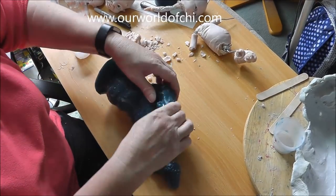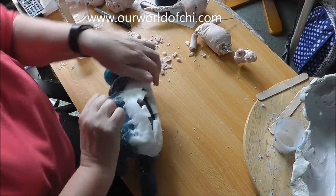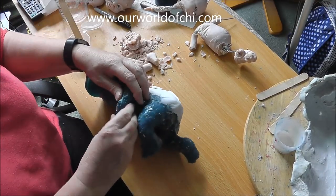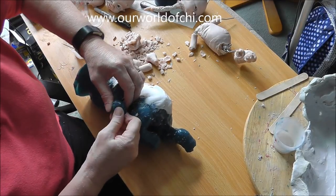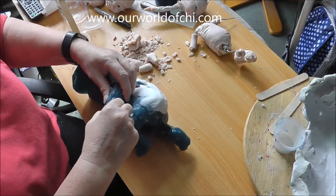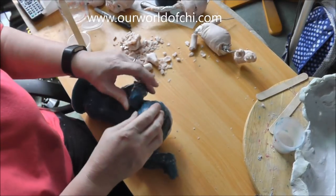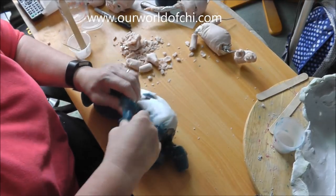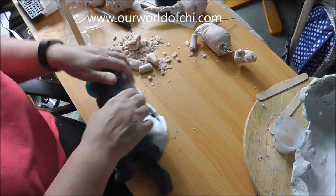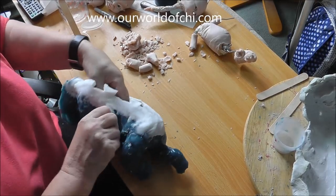I tend to do moulds too thick to fully turn inside out unless I absolutely have to, so I prefer to work the sculpt out with my fingers rather than pulling it inside out, because it can stretch and tear. The foot's out — I have to make sure the little toes are out. It's so easy to leave a toe in, and then you pour it and you can't work out why one toe isn't coming out in your silicone. Left his little willy behind too. Same with the fingers — make sure they're all out, because if there's a little clay finger left in it your pour will consistently come out with one finger missing.